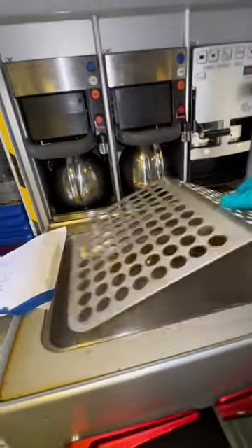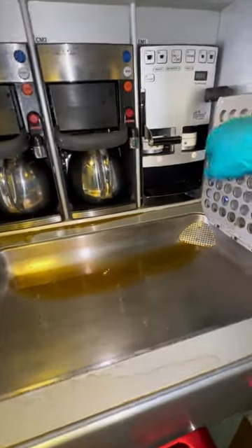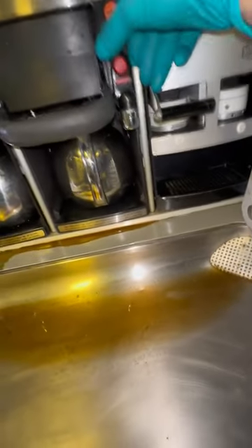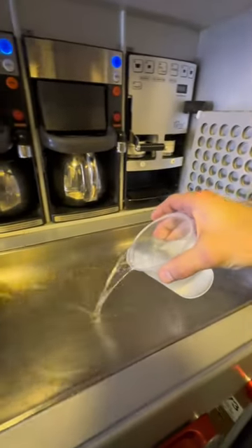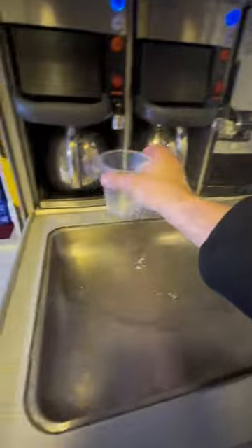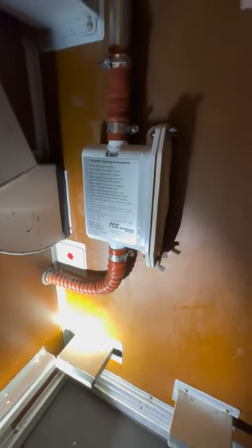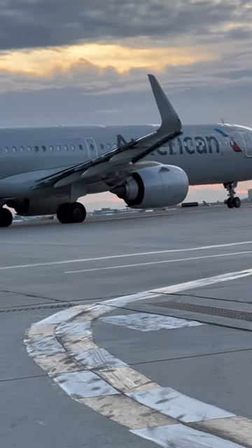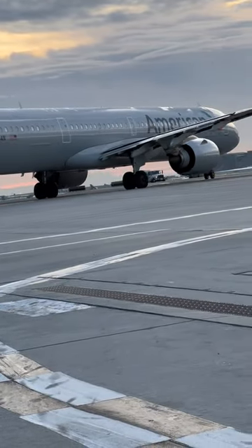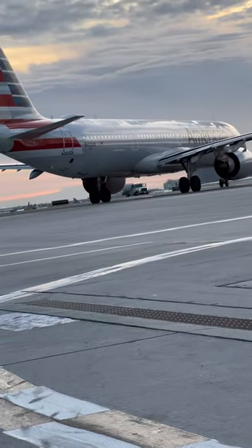All done — let's do an ops check. I used a little bit of hot water, cleaned up the surrounding area, and did a leak check to make sure there's no leakage at the strainer. As you can see, everything is cleaned up, everything is good to go — done. The aircraft is back into service and back flying. Hope you guys enjoyed this. That's us as aircraft maintenance — we do it all, we fix it all. We fix it, you fly. Take care, have a good one.